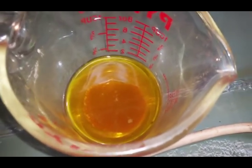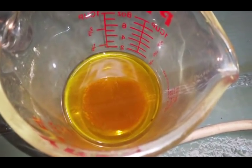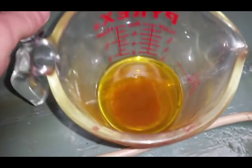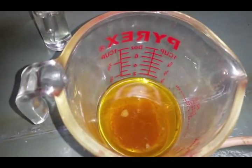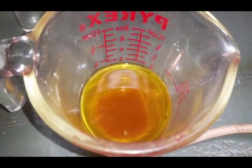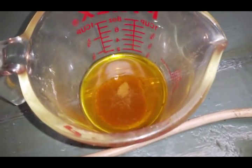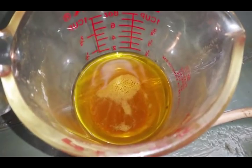So I added a few more drops of the nitric acid. And you see it picked up the reaction a little bit, but it slowed down in the last probably 2 minutes. So it's probably going to need more. That's why you add it incrementally, though, so you don't add too much at once, like I mentioned earlier about the excess free nitric. So we'll go ahead and add just a tad bit more. We'll do one more shot, and what I mean by shot is dropper. And you should watch it pick back up. And this is no longer aqua regia at this point because there is gold in solution. So it becomes chloroauric acid. Yeah, see, that picked up the reaction quite a bit.